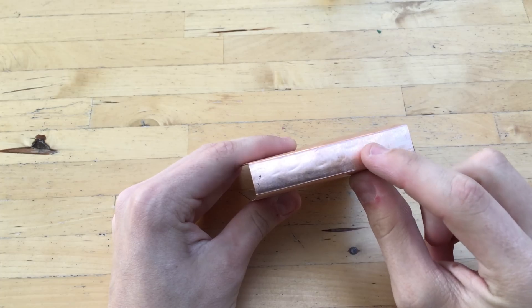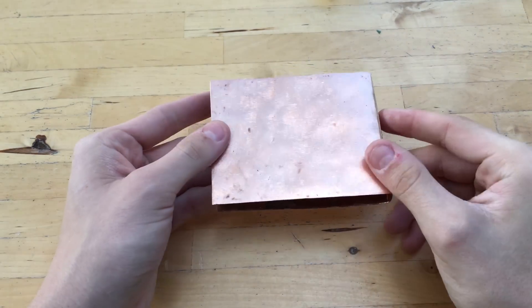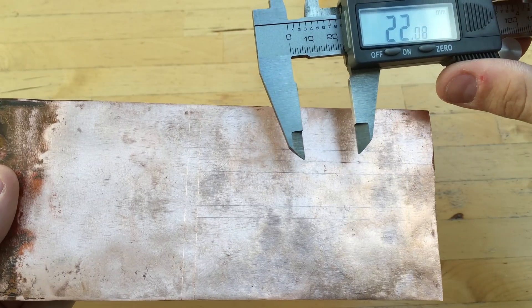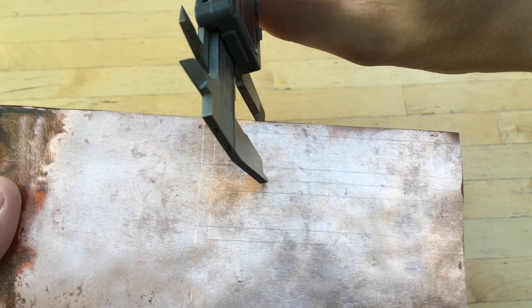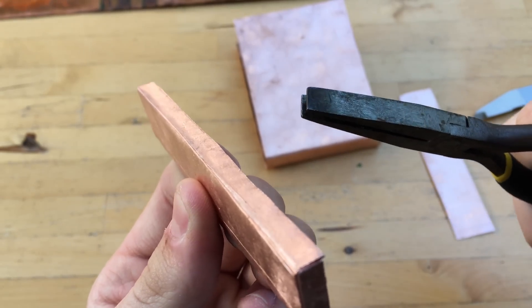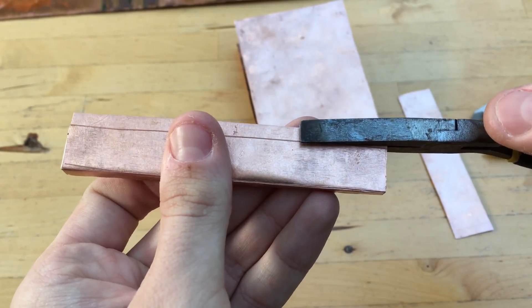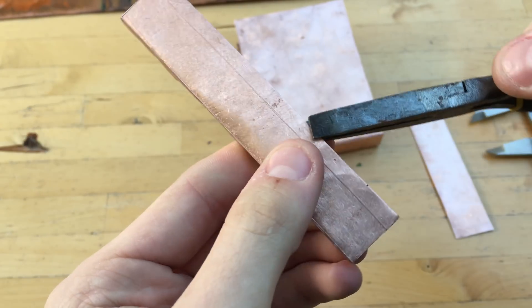This right here is 14 millimeters wide and 102 millimeters long. The next step is to make a pattern for the side pieces that are going to go in here and then solder it together. I've scratched the pattern for the two side pieces into the copper using digital calipers to measure the correct distance. I used flat-bladed pliers and went along the edge to slowly bend along the length of the copper sheet.